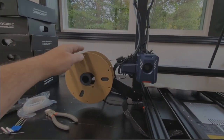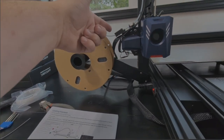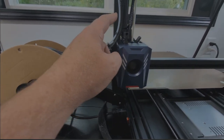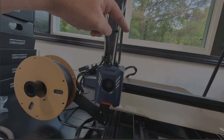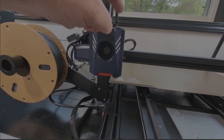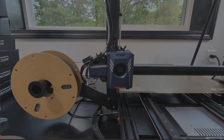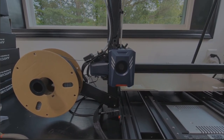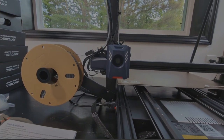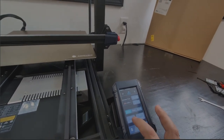I got a spool of filament out. The book shows the filament should come across the top through the feed sensor, then up through this tube — you just hand-feed it through here. When you get to the extruder, you push down on it as you feed more through until it stops, then let go. In layman's terms, pushing opens the nozzle grip so when you let go it grips the filament and can feed the rest as needed. Then you wait for temperature to come up to temp and click extrude.